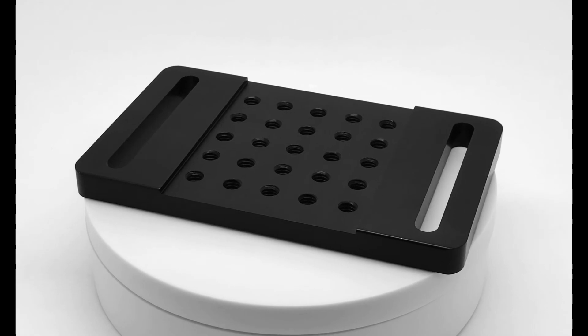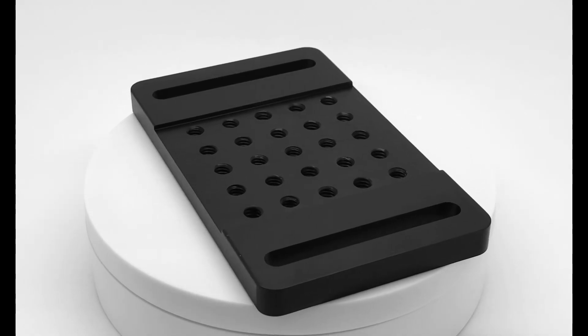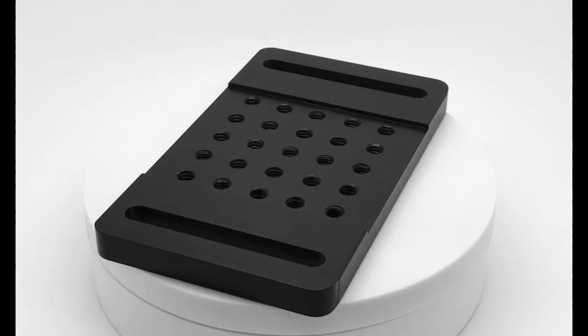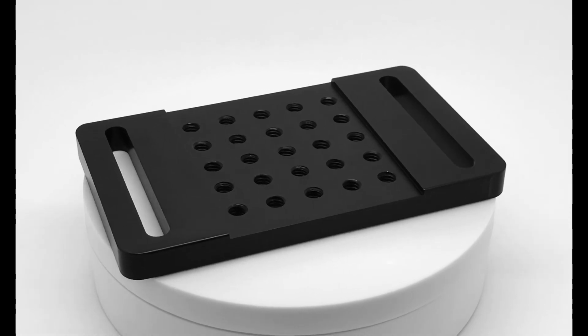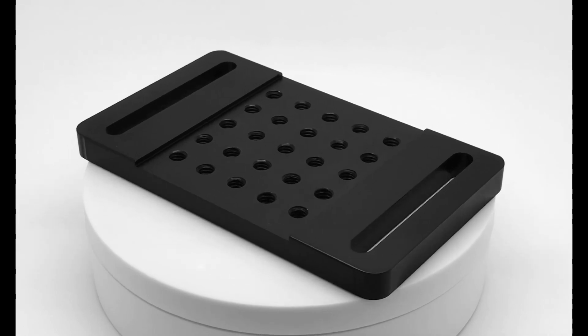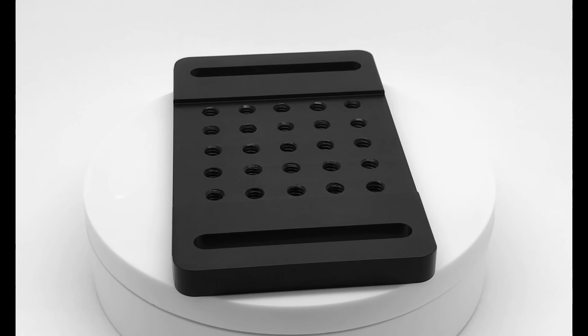Lastly is the B3X5A or B75X125A-M mounting base. This dual slotted mounting baseplate has dimensions of 3 by 5 inches or 75 by 125 millimeters. The mounting baseplate has a 5 by 5 array of 1/4-20 threaded holes to offer a variety of places to mount your optics. The two clearance slots allow for easy mounting to either imperial or metric breadboards, to be used as an adapter plate.